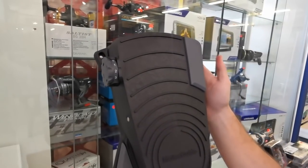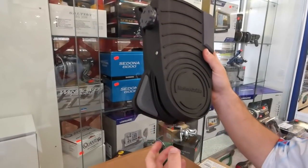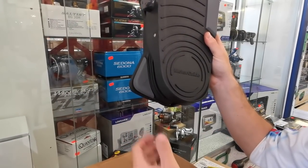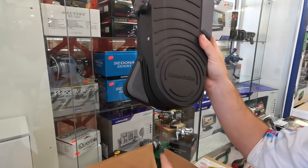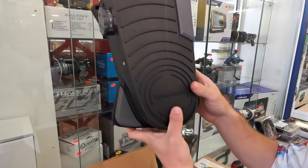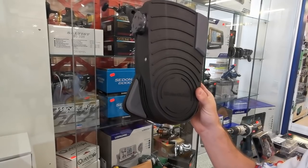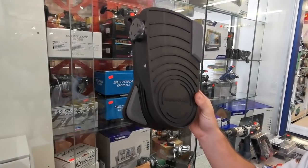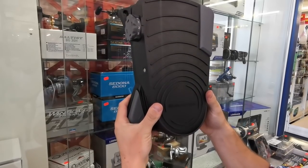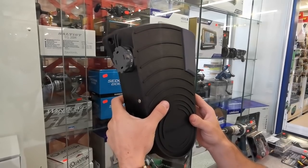You've got your fire button — what I call the fire button — which actually lets the motor run. You've also got your anchor button; once it's paired and the GPS is in there, hit the anchor and it'll hold you exactly where you are. Then you've got your motor on and motor off button. To pair these, you have to take the motor off power, put the motor back onto power, press and hold both of these and then it'll sync to the motor. Once we get that on the test bench I'll show you how that works.